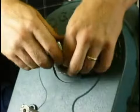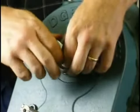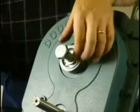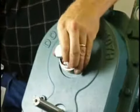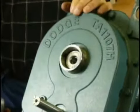When this is done, since you've got it against it, it's now a hand turn and it's tight. To remove the tapered adapter, simply drive the removal bolt in against the shaft and it pries the adapter out of there. Now you're ready to remove the driveshaft from the gearbox.